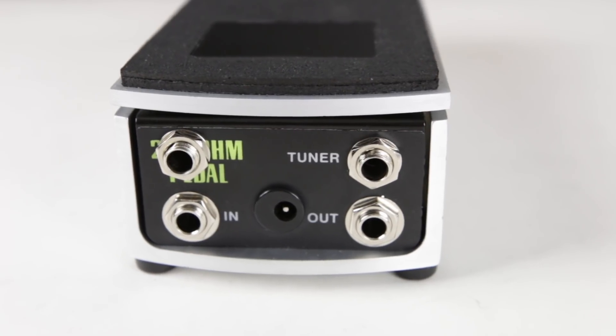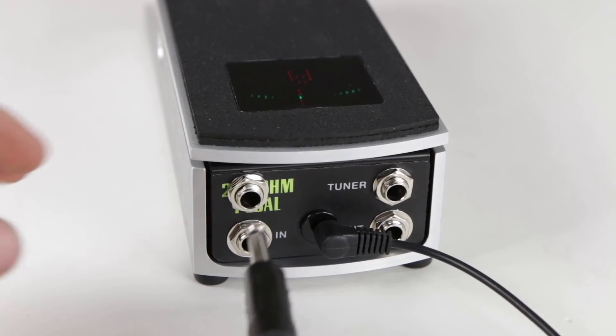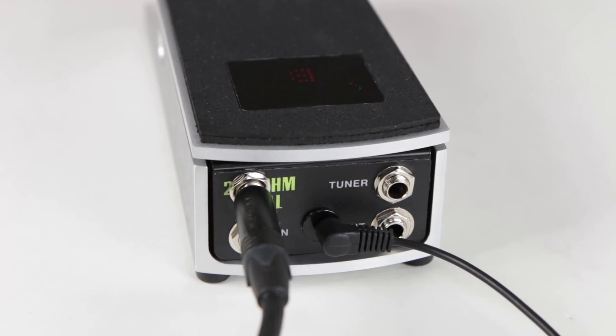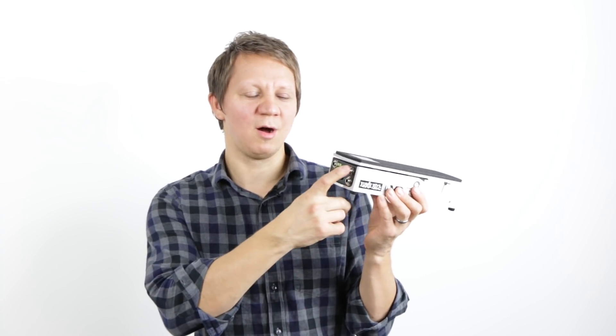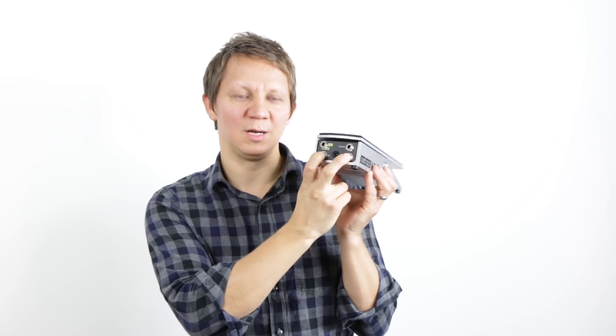I did this because it's very flexible — the tuner will usually go right from your guitar into the tuner. You tune with a clean guitar signal and you're buffering your signal. From there you can run into drive pedals and distortion pedals, and then from the distortion pedals you return back into the volume section, which is the bottom two jacks.